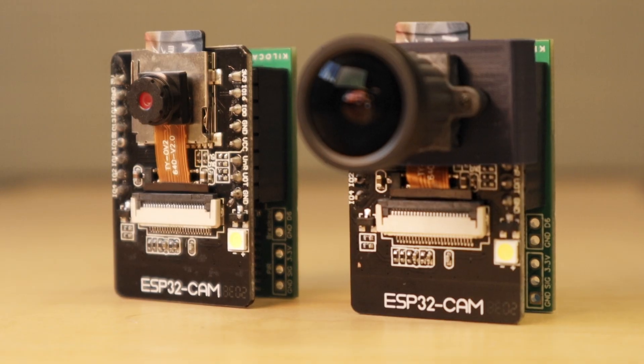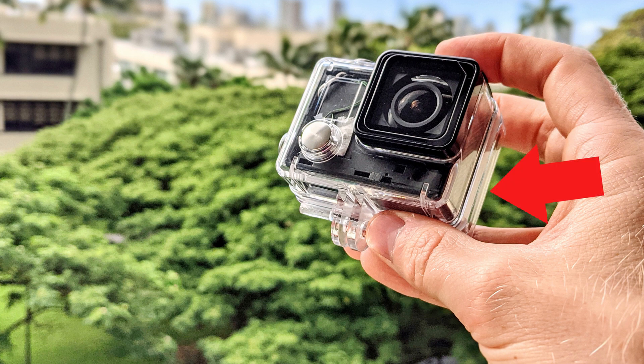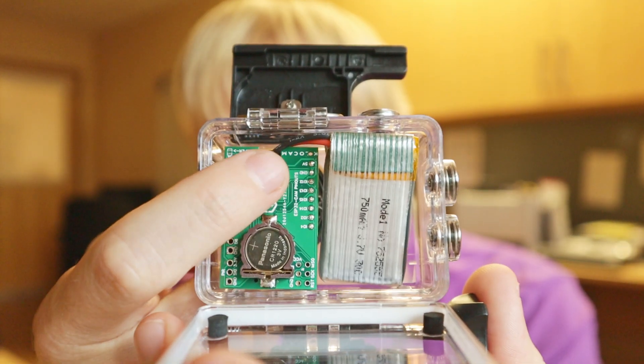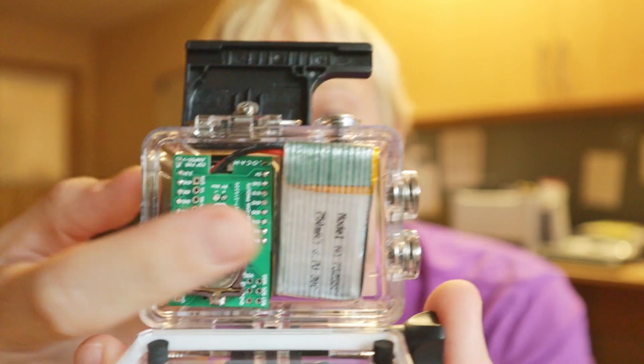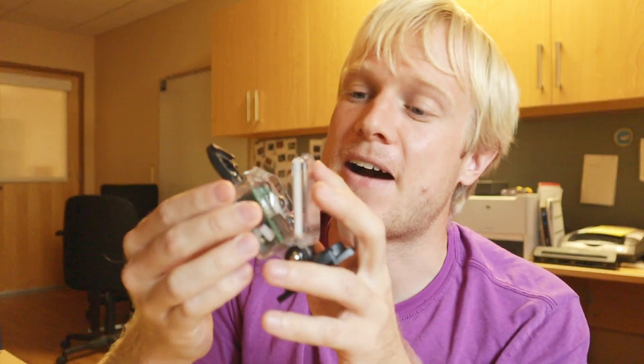Two really quick cool side notes. First, if you aren't happy with the default lens on these ESP32 cams, based on some work from a YouTube channel I'll link below, I have found a way to 3D print an adapter so you could attach other lenses, like this fisheye lens that I took off of a CoralCam. These are standard 12 mm threaded lenses that you can find a ton of online. Side note number two: CoralCam required the use of an extended back door for its housing to fit the PCB and the battery. Unfortunately, those extended back doors never seem to fit the cheap GoPro housings that come with those knockoff action cameras. So I end up having tons of them sitting around in cabinets — I literally have like 40 of these things. Well, I have found a use for them, because KeloCam fits perfectly in a standard GoPro Hero 3, Hero 4, Hero 5 housing, and you can also fit the 750 milliamp hour LiPo cell in there. I have finally found a use for all of my extra GoPro housings.